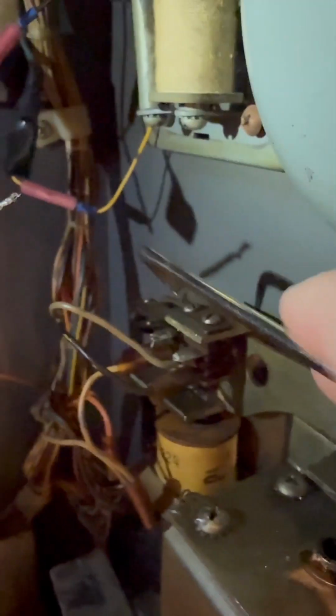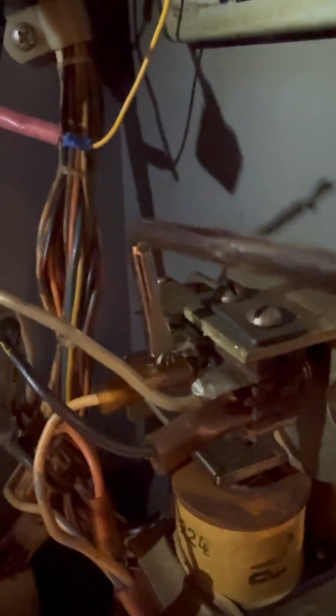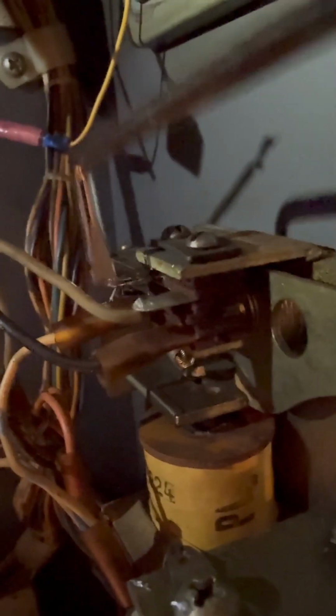So all right, let's go back over here. This is the handle, right? And if you look closer, that's the switch. And lo and behold, there is nothing connected right there. That one right there is not connected at all. There's nothing there. So this wire is probably connected there. So what probably happened, I'm assuming I'm right, if I've read the schematic right, is this was, can I focus a little bit?